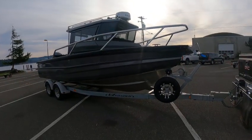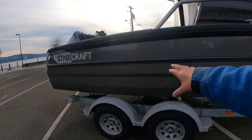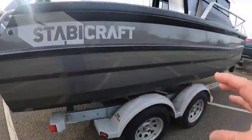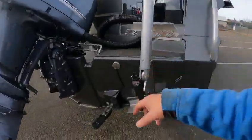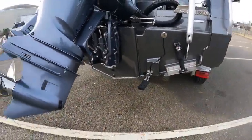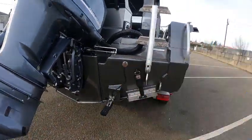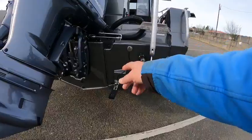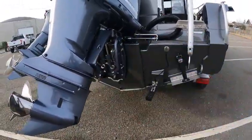If you get hit from right or left coming in on some big 10- to 13-footers, they're pretty impressive. Fuel economy is awesome and they've got the pre-flex — that's where these are bent — so these are chambered plus the main hull, virtually unsinkable. Got your gas vent, your ladder, GT51 transducer. There are three chambers, and your main drain is right there. Check that one — pull it out when you get home. Once a month pull the bottom ones too — you should hear a poof of air, no water.